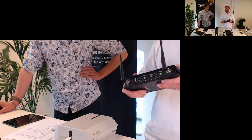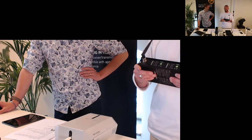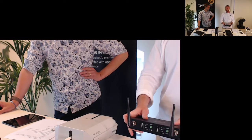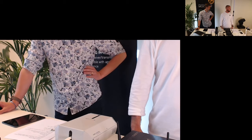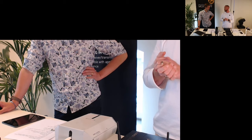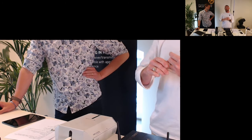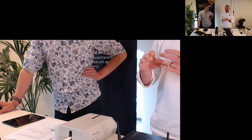The range, in best case — wife's happy, sun is shining — is a thousand meters for the standard boxes with standard antennas. You can of course use different antennas. For indoor we have a 5 dBi high-gain antenna; for the outdoor boxes and Slim we have a 6 dBi antenna, and also a 12 dBi directional antenna. We'll talk more about how to align them later.